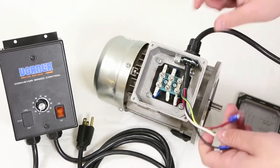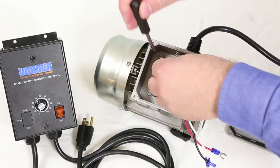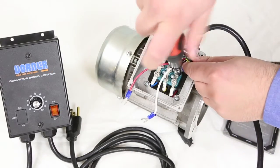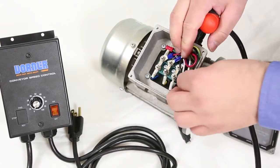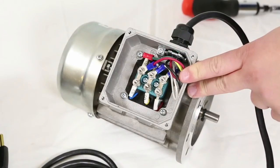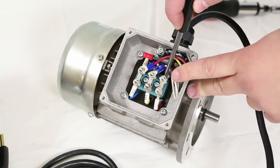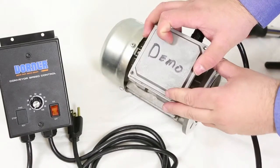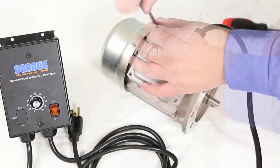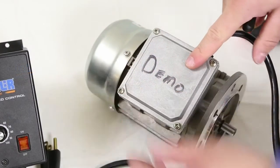The green ground wire goes to a grounding terminal inside the motor itself. Then attach the three power leads. If you power up the motor and find that it's rotating in the wrong direction for forward, you can easily switch any two power leads to reverse the direction of the motor. Close up your terminal box and replace the screws. Be sure to tighten the cord grip cover.